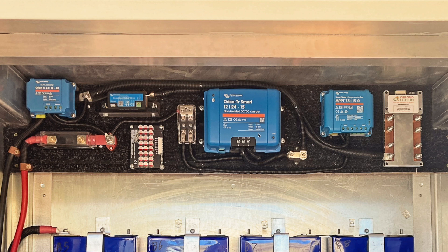This next one is a DC to DC charger. It comes off the battery under the bonnet of the car, supplies 12V in, and converts it to a 24V up to 15A charge — that's what charges these batteries. When the car starts, this charger activates and starts charging; when the car turns off, it deactivates. You can set all the voltage parameters in the Bluetooth settings to disconnect at whatever voltage you like — 12V, 13V, 12.95V — they're really programmable.